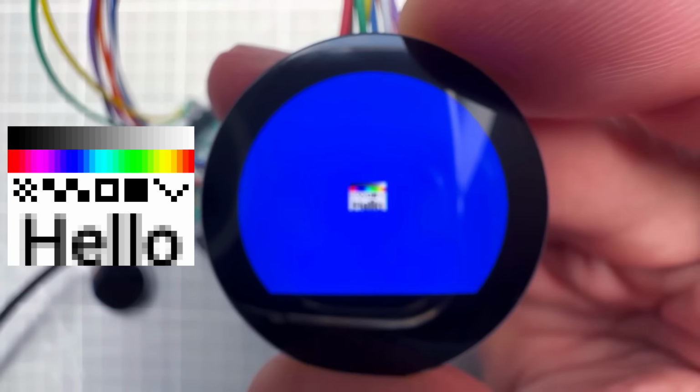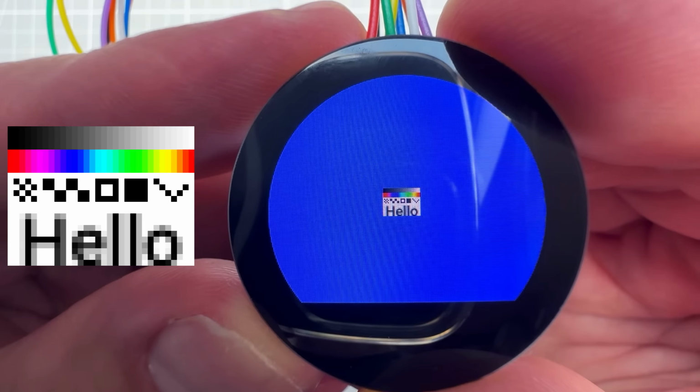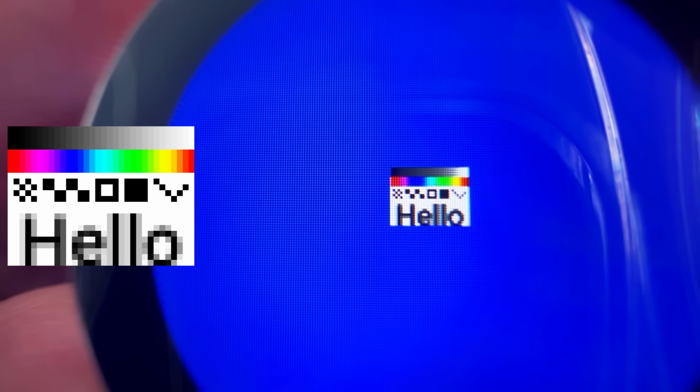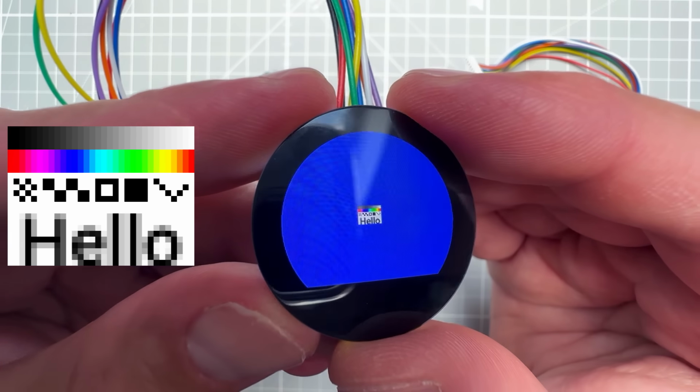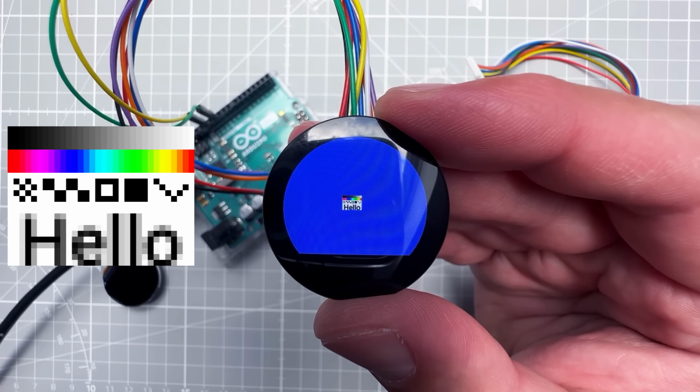That's also because I already knew that you have to click the MSB first checkbox in the image to LCD converter utility, and that you have to set the addresses inside the Arduino code 1 pixel smaller. Now this image is nice, but it's very tiny, so what if we want to draw a much bigger image or maybe more images?